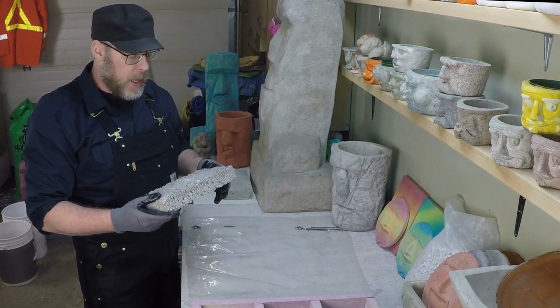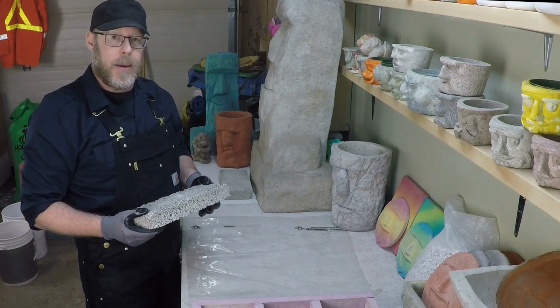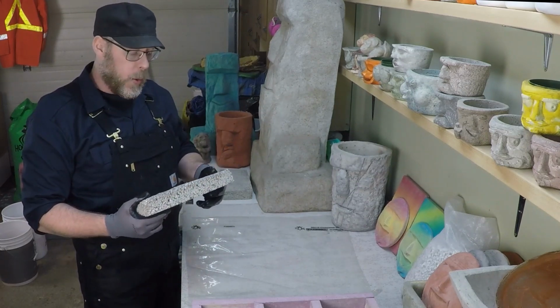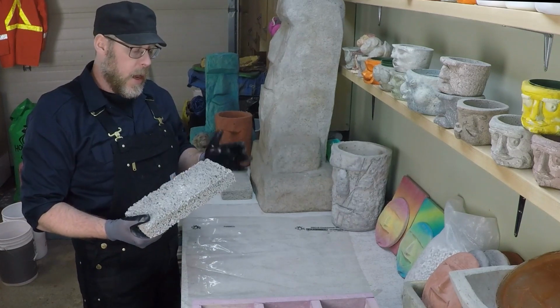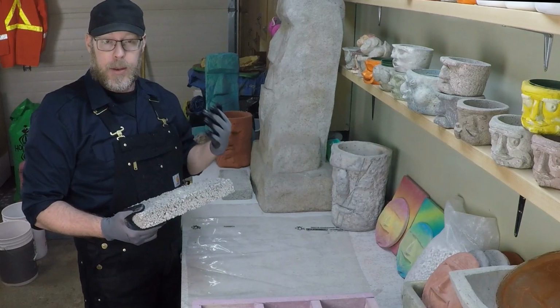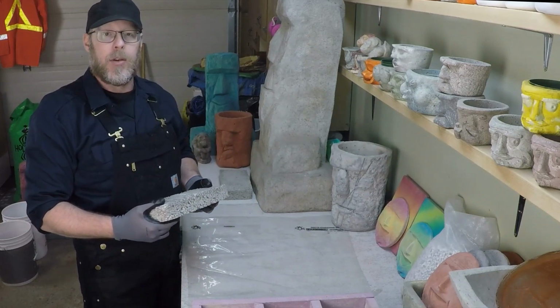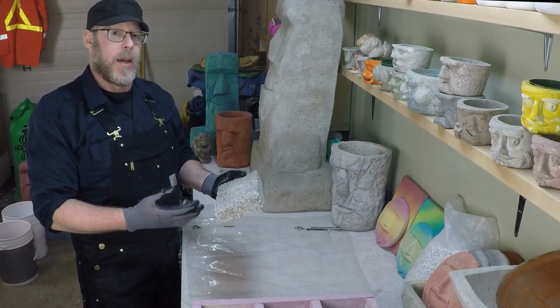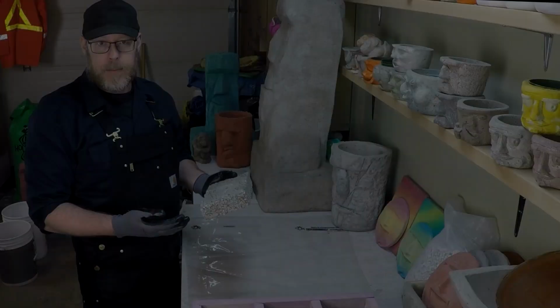So when it comes to making lightweight concrete last a long time, there's not a lot that you can do because it's going to wear aggressively and wear quickly. It's not all that strong, and it probably absorbs more water than it's supposed to. But you can try to physically protect it from damage, and you can also try to seal it with an absorbing concrete sealer like acrylic or epoxy-based.